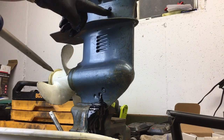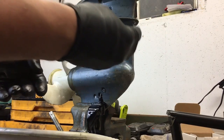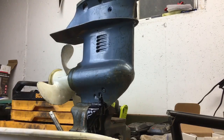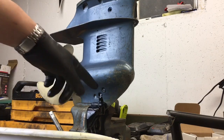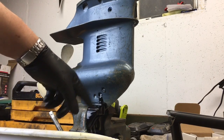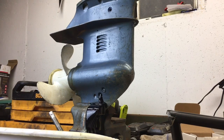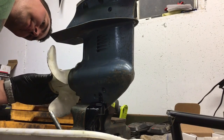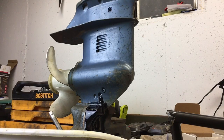You want to watch out because there are these little o-rings — make sure those don't get lost. I don't see one on this plug; it's probably still in there, or it did fall off, and that's why all the water got into the lower unit. Because oil floats on top of water, when you drain it out and get water, that'll be the first thing that comes out. I think we're gonna have to pull off the propeller to see what's going on back there.